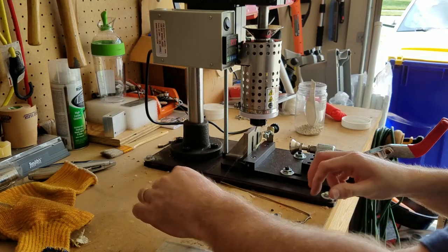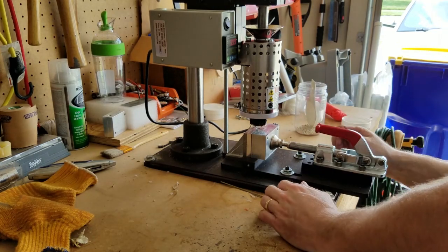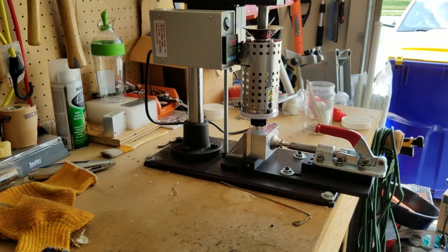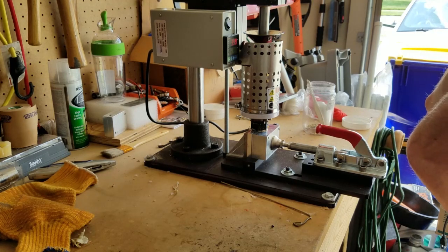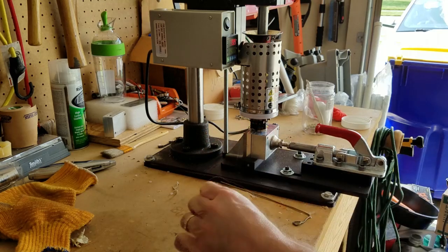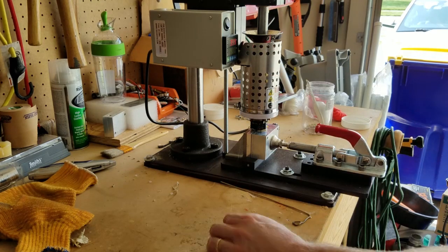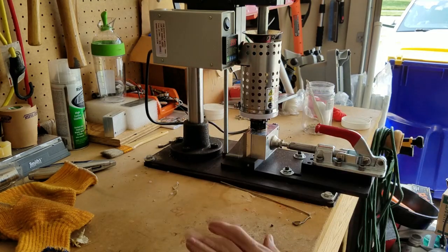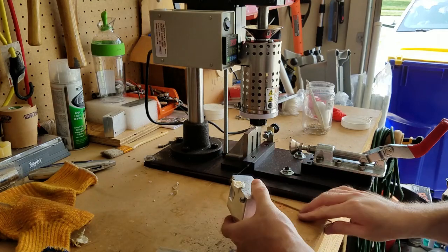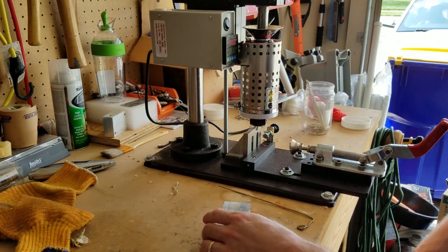I didn't even line that up right — it went all the way over to the mold stop. I didn't fill the hopper, but that's okay. With this particular mold and machine, I can get about two or three shots — sometimes four — before I need to fill the hopper, but I like to fill it every time to make sure I have enough material. I cooled it down a little bit and now it's getting kind of hard to flow into the mold. With this digital controller, just knock it up to 410 from 400. It probably did not fill the mold — actually it did. You can see it was a little bit harder, but depending on the type of material, it's going to be a little more difficult.